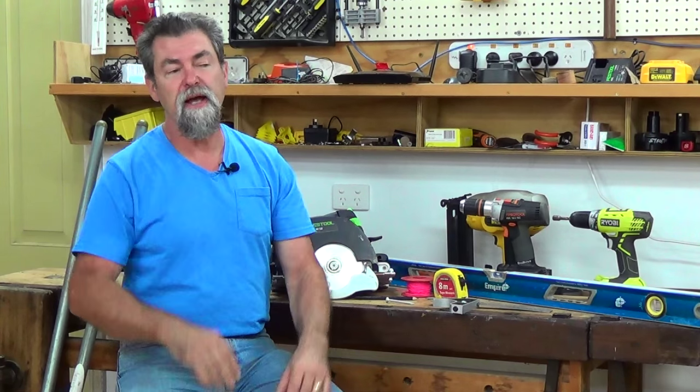All right, now we've got all our rails in. The chain link. Make sure that you have the height between your top and bottom mortises the right height for the chain link. Now, most chain link you can buy at 912mm, which is 3 feet. A roofing screw in either corner to pull it tight, and then little U-shaped staples. You know, they're the heavy galvanized staples that you can tap in. Put them around and it'll look great.